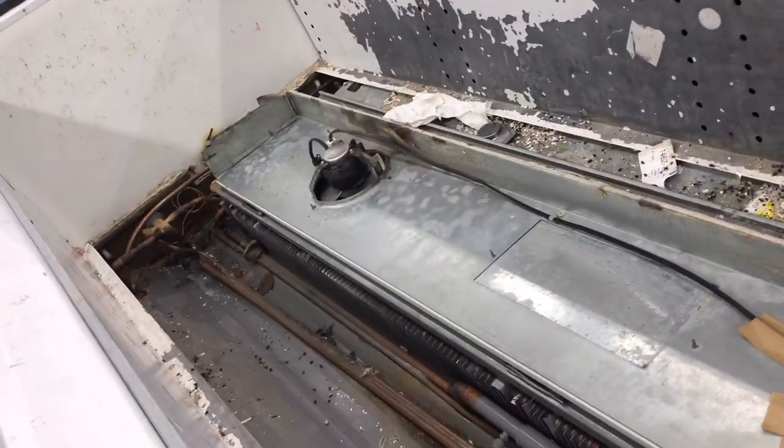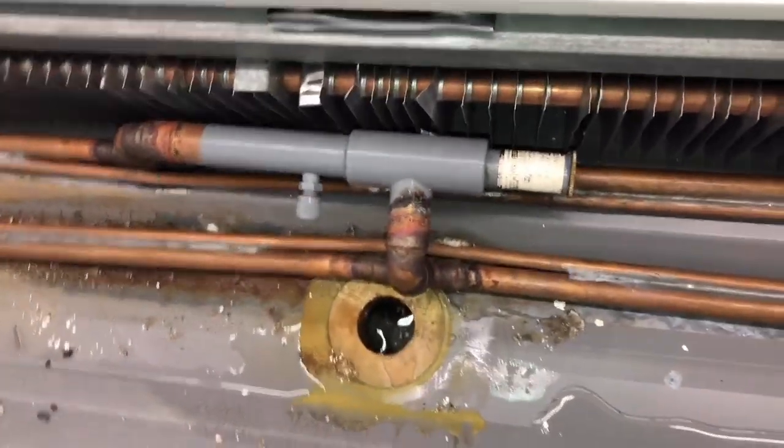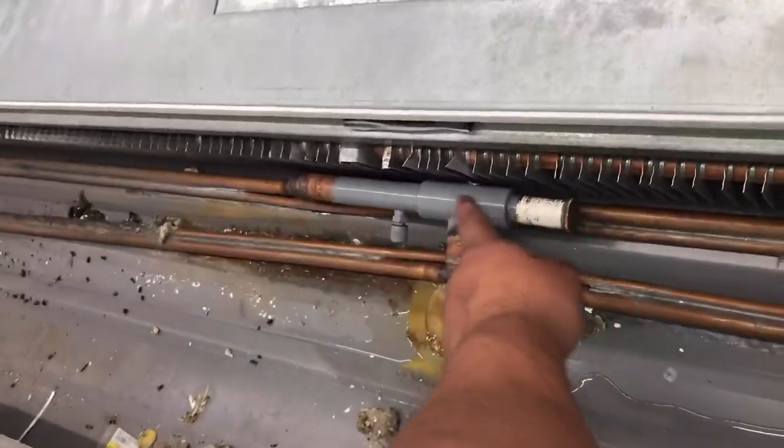Going back out to the case. This system is not going to have a thermostat — they are using it as a dual temp. You can see the solenoid right here, check valves right there. Either the refrigerant will be forced to go through here and back out to suction, or it will take the path of least resistance and go this way out to suction.